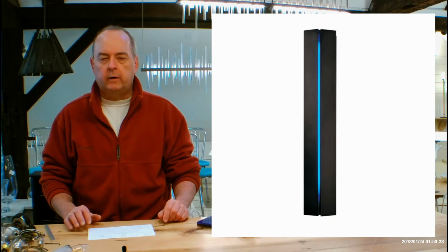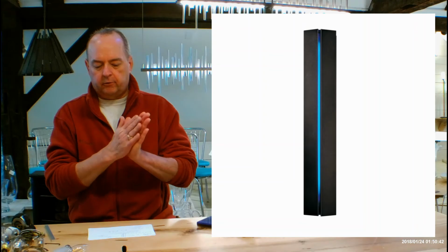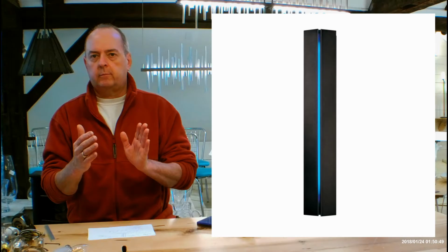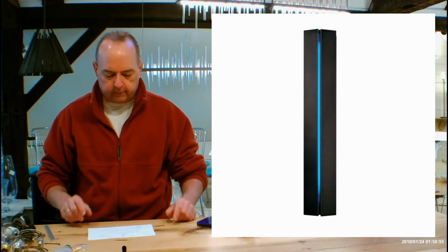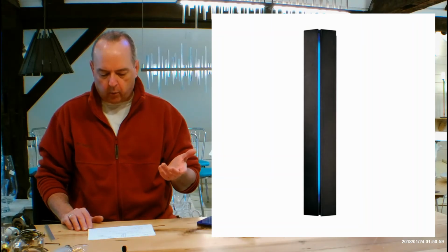This is the one that's going to be 24.5 inches tall, 4.3 inches wide, has a projection off the wall of 3.3 inches. That qualifies this to be ADA compliant, that's Americans with Disabilities Act, which says that a sconce has to be less than 4 inches in projection out from the wall, and this qualifies. Okay, backplate is 23 by 4.1.